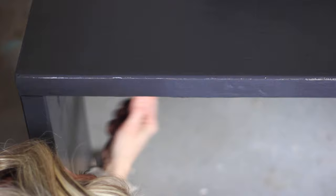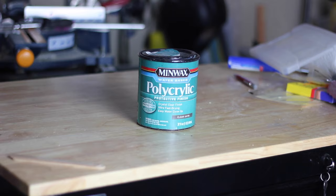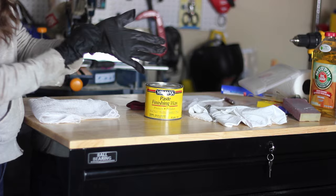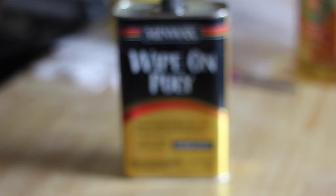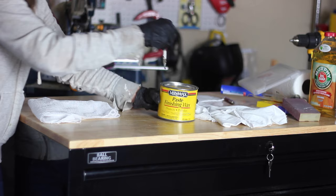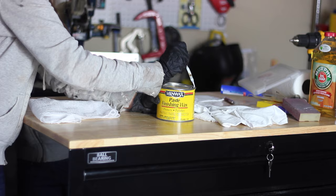After my second and last coat of paint has dried it's time to add a top coat for protection. My two favorite top coats for painted furniture are Minwax Polycrylic, which I usually apply with a brush, and Minwax Paste Finish Wax in natural. You can use polyurethane if you prefer a super durable oil-based finish — in that case I would use satin wipe-on poly — but I prefer to use that for stained furniture, not painted furniture. For this project I'm going to finish it with paste wax. I wear gloves since this can get messy and apply it through a couple layers of cheesecloth, rub it on and allow it to sit for about 10 to 15 minutes per the instructions. Then I go back in with a clean cotton cloth and buff it to as shiny as I want it, and allow it to cure completely before using.